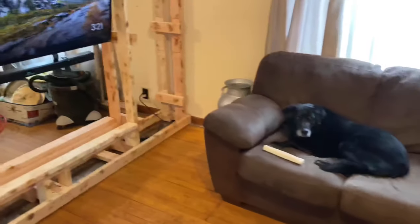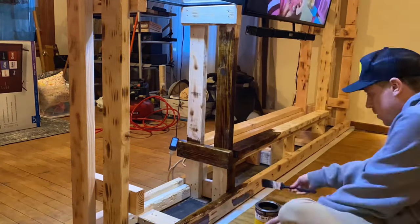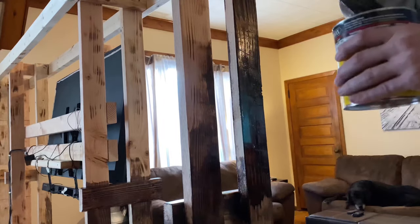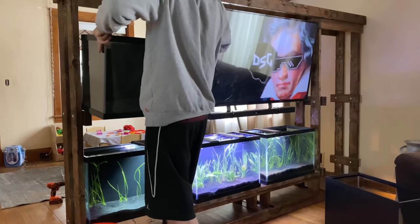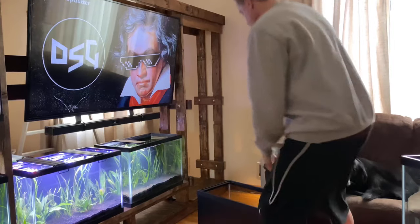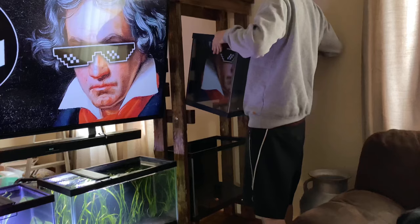One thing I didn't get footage of is how well I screwed and braced this thing to the floor. I literally have eight-inch screws going into the floor beams and joist hangers, because this thing is only about 15 inches wide — if someone leaned against it, it would tip over. It really needed to be structurally screwed to the ground. As you can see, I stained it a darker color — it turned out darker than I anticipated. I tried to match the flooring color, which was like a honey oak, but pine takes stain differently than oak does.